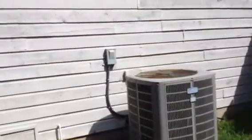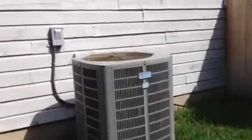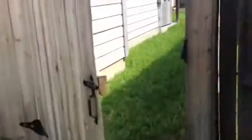We got our AC unit. We'll side behind any of the conduit there. We'll retrim out these little vents in Hardie plank, so that won't rot. Here's your one window here. All corner trim, all interior corner trim, exterior will all be 1x4, 1x2 Hardie plank.